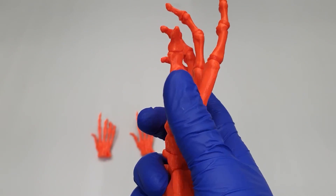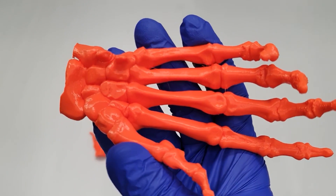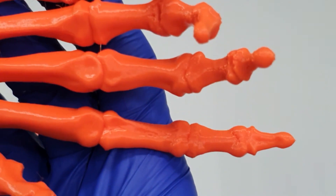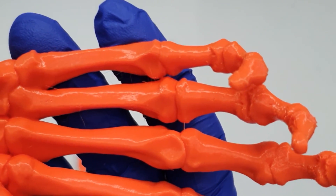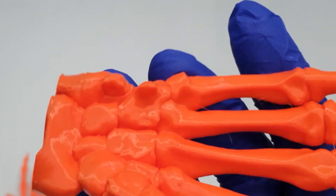In this video I will be showing you how to very simply smooth the surface of a PLA 3D printed object. As many of you might know, fused deposition modeling, also known as FDM printing, leaves quite distinctive layer lines. To remove these you normally must either fill them in with wax, resin, or sand them down.